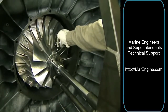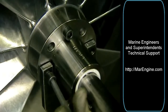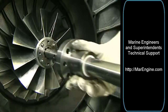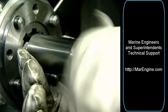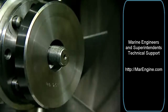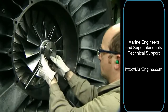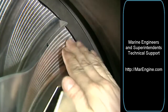Align the compressor wheel with the balancing marks. Slide the compressor wheel onto the rotor. Remove the suspension device. Move the compressor wheel into its end position using the assembly ring and the pressure disc of the tension nut. The hub collar of the wheel must be flush with the bearing casing.